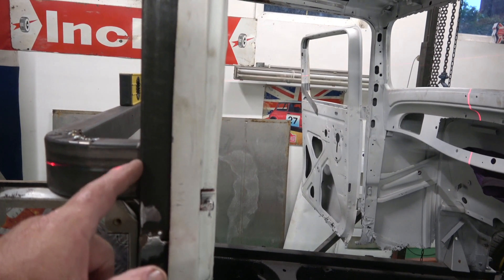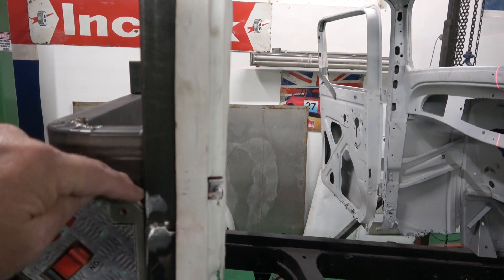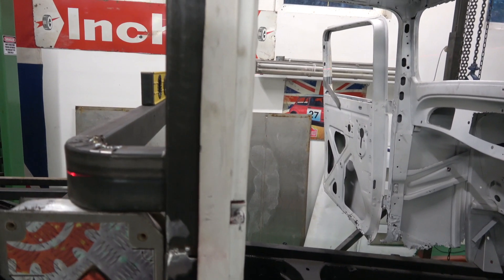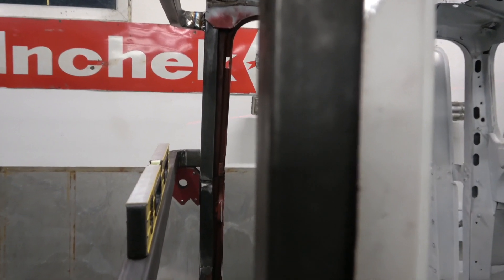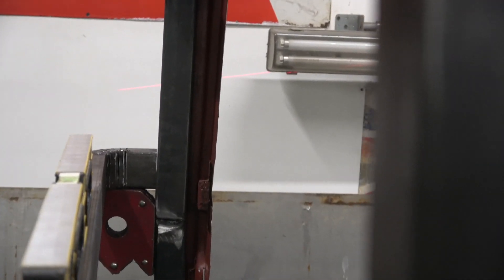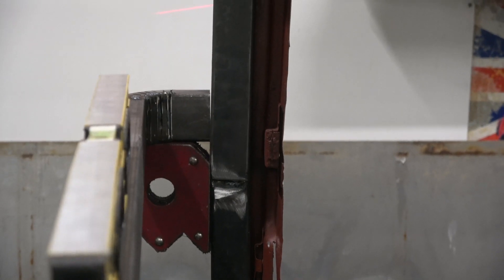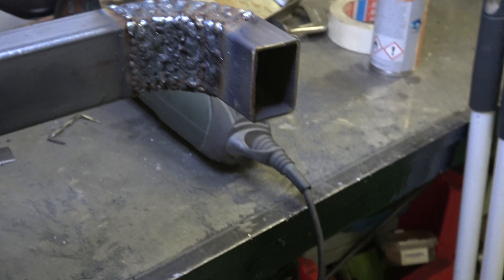What I need to do now is open this up a little bit, come out a couple of millimetres, and also cut a bit of an angle so it's more flush with that upright. You can just see the gap on the other side — there's a gap at the top, actually almost all the way down. So I'll take a little edge off that and it will make a nice tight fit when I weld it.